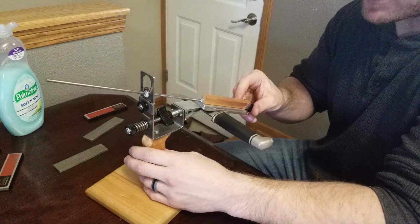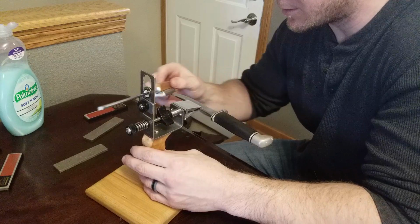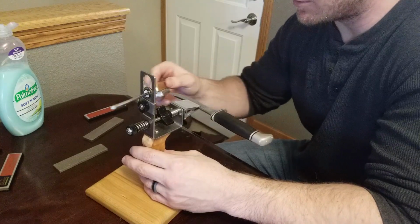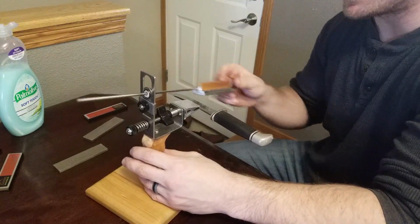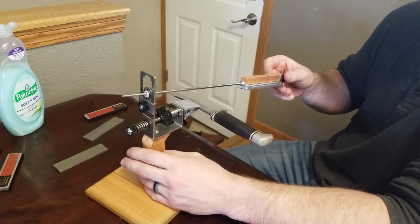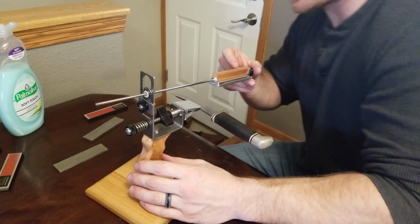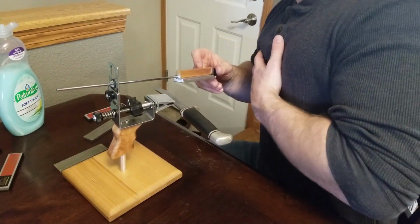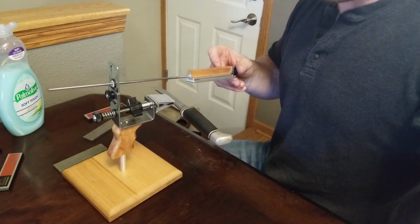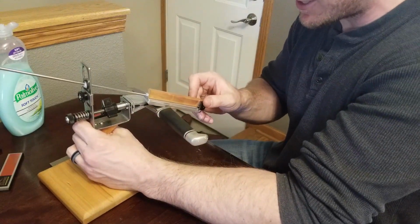And I guess when I'm working with something that's this used, 1, 2, 3, I think I'm using too many upstrokes. 1, 2, 3. A good sharpener will probably just use 1 or 2 and be done with it. But when I'm working with something that's this old and this beat up, I imagine that with reprofiling you really just have to be patient and take your time with it, not get overly focused on moving on to the next grit as fast as I can. This is obviously something that requires a lot of patience, so I'm going to have to learn how to do that.